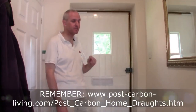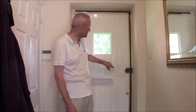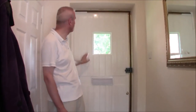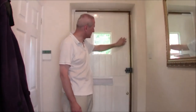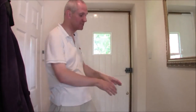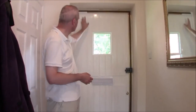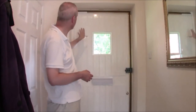A complete step-by-step photo build is on our website — see the address at the bottom of the screen. First, we bought an inch-thick layer of polystyrene and put it inside the inset — the photographs make it much clearer. It was then glued in place with a quite tight fit, the same at the bottom as well. Next, we fitted wooden panels over the top. Those wooden panels are a decorative feature you buy in DIY stores — it's just MDF and actually quite expensive. The panels are normally designed to go against a wall and create a decorative Victorian feel; we repurposed them here, using a couple of sheets cut to shape with the window in the middle, then glued and nailed over the polystyrene for a good cosmetic finish.